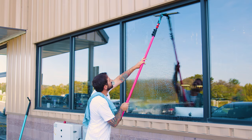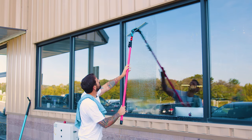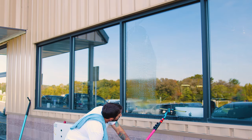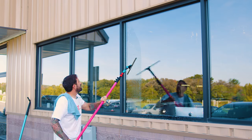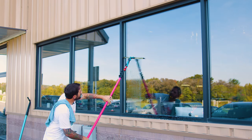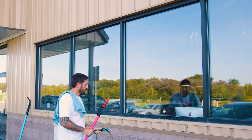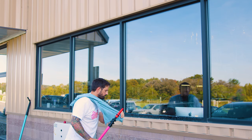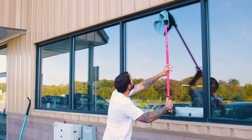The next pull is to angle the squeegee so that your water moves up the squeegee, coming all the way down to the frame. This is a great way to start when you're pulling windows that are just a little bit too tall for you. If you do that, just make sure to detail your edges and your top.